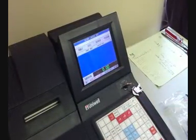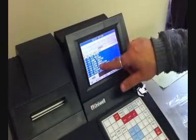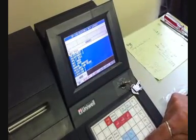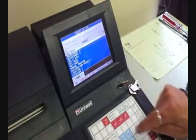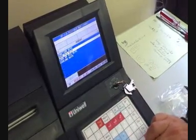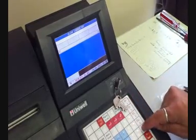The final step is to remove these keys from the keyboard. Sign on as Robert to access program functions. Go to option 110, flexible keyboard layout, and press Enter. Select function keys and Enter — the function keys are listed as not used. Select each key and press it, scroll back up, Enter, select it, and put that on. Scroll up, Enter. Those keys now have no function assigned. Press Clear a few times until you hear the other beep, then press Clear — and those keys no longer work.